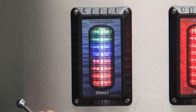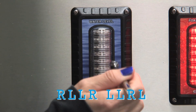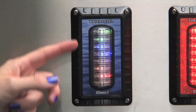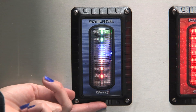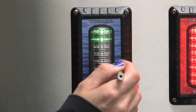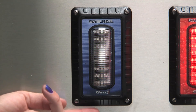To calibrate a 2-point calibration with an empty water tank going to a full water tank, do the calibration sequence: right, left, left, right, left, left, right, left. It's going to read number 2 and then tell you to set empty. Make sure the tank is empty, then trigger the right-hand switch to set the empty point. The top 2 LEDs come on and it scrolls the message 'set full.'